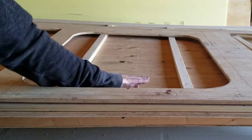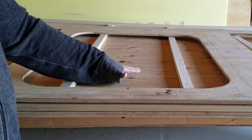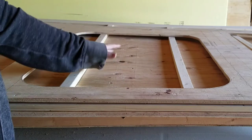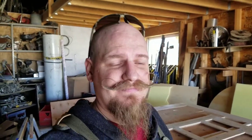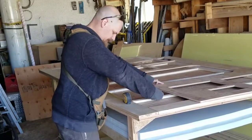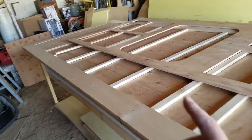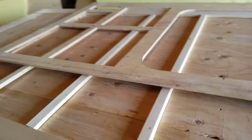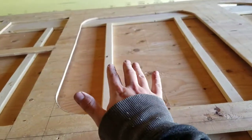Remember, there's going to be insulation and plywood on top of this. These spacers are mainly so that there's no dipping in the insulation from the top pieces of plywood. Since those two are about 16 inches on center, I decided on 15 inches on center for the rest — because that'll give me a decent distribution in the doorway.